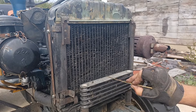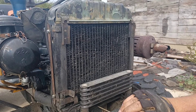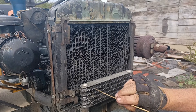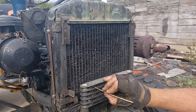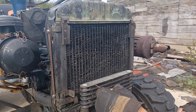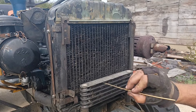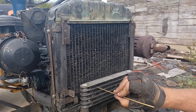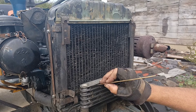I don't see any more clogged cells. But while we're down here, we also don't want to neglect our oil cooler, which is this little radiator up here in front that cools our hydraulic oil. I have never done a thorough cleaning of this — haven't given it as much attention as I should — and it's got some spots that look pretty well clogged. The fins are a lot closer together, so my skewer doesn't quite fit in there.